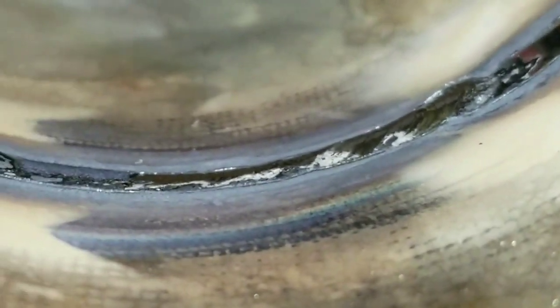As it's cooling down, the inside and out just pops right off. Here's a profile view of that root on the inside. I did a tie-in, so you can see it ties in right there in the middle. That little piece is some slag still left in there, but it tied in real good and shiny.